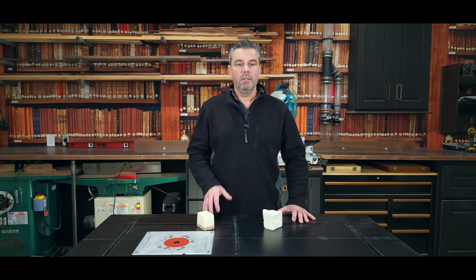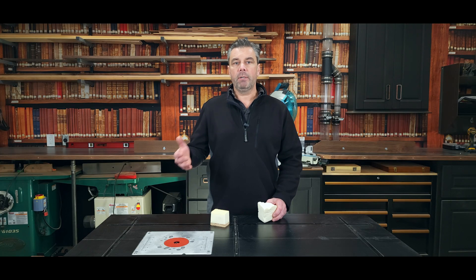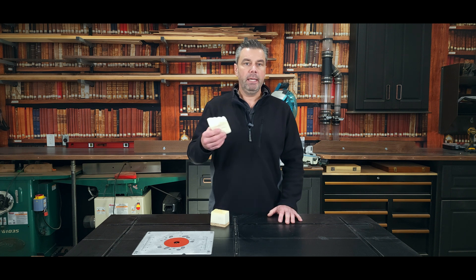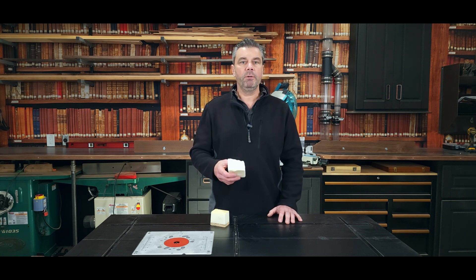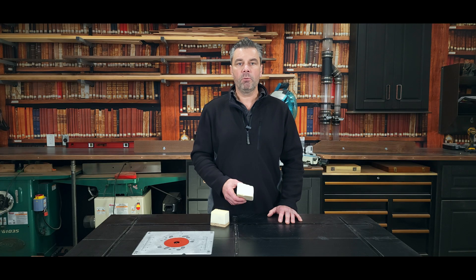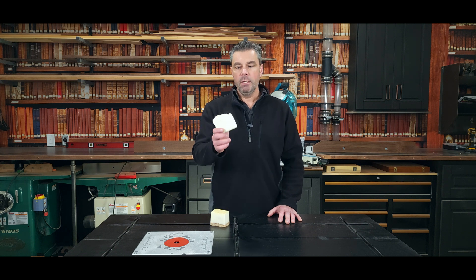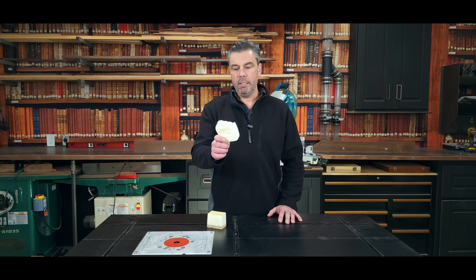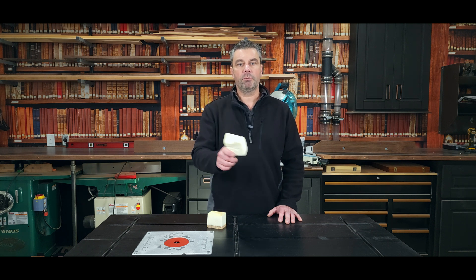So let's go back to the original question: which one of these two products is correct for your project? If you have exterior walls or attic space that needs to be done, you might be able to get away with the open cell foam — I wouldn't really steer you in that direction, but it will solve the problem. You're not going to get an air barrier and you will get a lower R value, but you'll also get a lower price tag. If you're talking basements, crawl spaces, or any area where you might have a moisture issue, take open cell off the list and go directly to the closed cell foam. For sound dampening, definitely save the money and go to the open cell — that's the right choice.